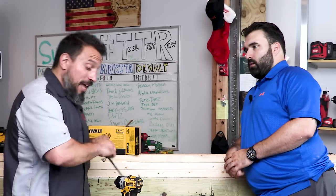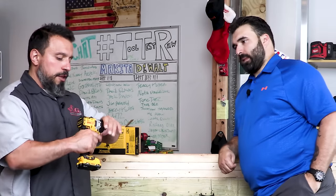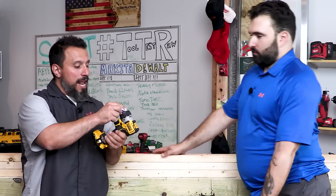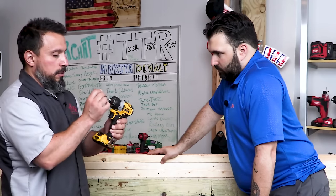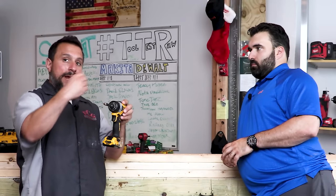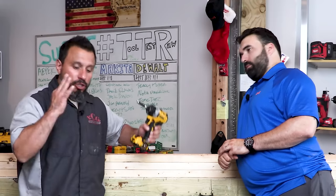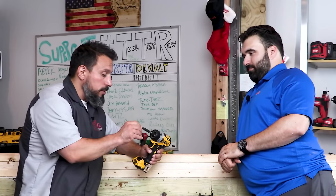Vince admits he has never personally used an electric screwdriver like this before. The key difference from an impact driver: even though it has a quarter-inch collet with quick insert and a ball-bearing retention system, this screwdriver does not make impacts. Everyone might look at it and think it's just an impact driver, but a screwdriver does not produce impacting action — it's purely rotational with adjustable clutch control.